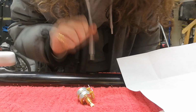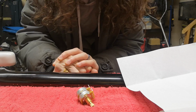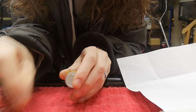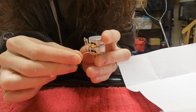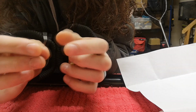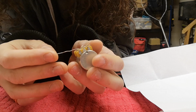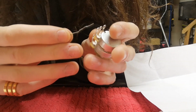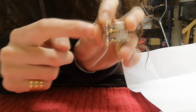The first thing I'm gonna do is set this guy up, and we're gonna see if I can do this. And I need my soldering gun. While we hate to wait, we have to wait for the soldering iron to heat up. So I'm taking a quick look at this, and as it shows, you have to go from the top middle to the bottom right with this resistor. You need to make a jumper. Now, I could always take a little wire and wire it together and then just solder the capacitor from there to the top of the pot, or I could just use the capacitor's long tail and use that as the jumper. So I can just feed this through and then bring it up and solder the two together like that. So now we're jumped.